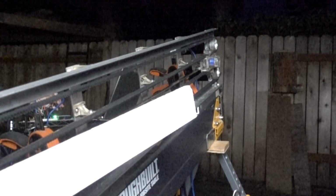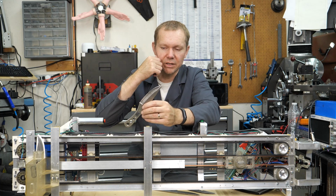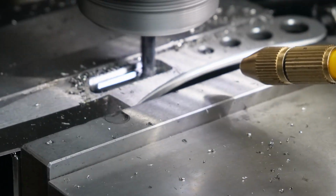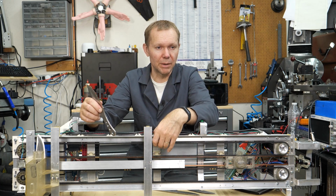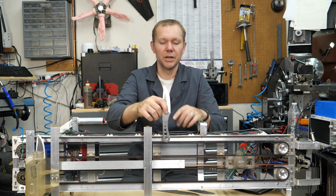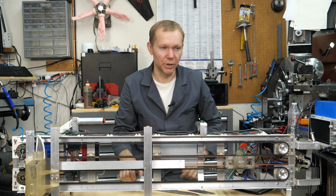And that happened so many times until we figured out, hey, and I was focusing on the solenoid fingers, thinking, how do I change the geometry at the solenoid to get this to work? And then I just took a break and thought about it for a while and thought, wait a minute, I can start to manipulate the shape of the knife. And said, let's try opening up this pocket, and that will automatically, as we're accelerating the knife along, have the fingers in that pocket, and it'll give something. It's not going to be a lot, but it probably gave us just enough give to compensate for the stretch in the belts, and that as everything starts to go to that constant speed in the middle, it gives enough of a break to the solenoid fingers to be able to retract. And that ultimately ended up working pretty well. Let's flip this thing around.